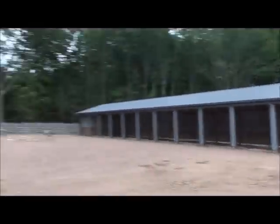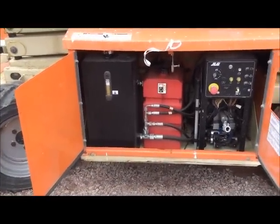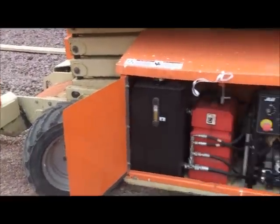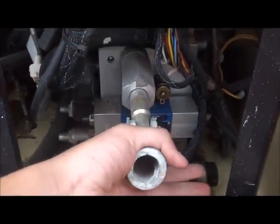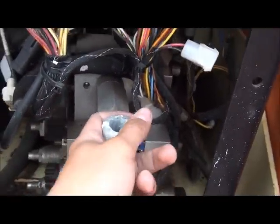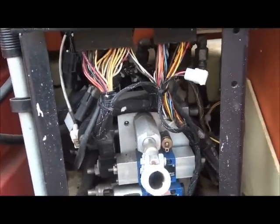This right here is to relieve your hydraulic pressure. Say you were way up in the air and you ran out of diesel, stalled out, someone falls — whatever happens and you need to get the platform back down. I'll push this up — yeah, actually nothing happens. Push it up and that will relieve your hydraulic pressure and it slowly comes back down.